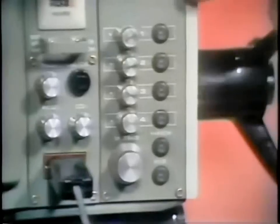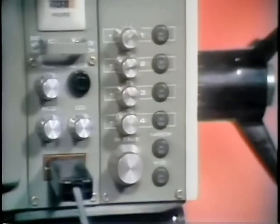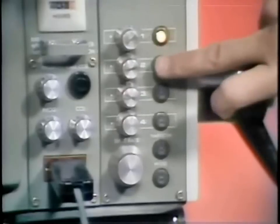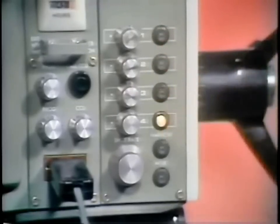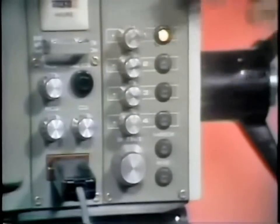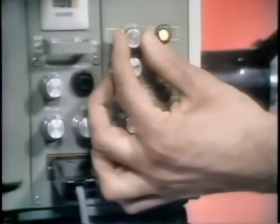This panel is probably the most important operationally on the back of the camera, and the only one likely to be operated during a production apart from star filters. These are preset positions for zoom lens angle. As I depress them the lights come on and they take over from manual operation. Using this little control I can set whatever particular angle I want, so if there's a point of reference I want to return to very quickly I can set it up here.